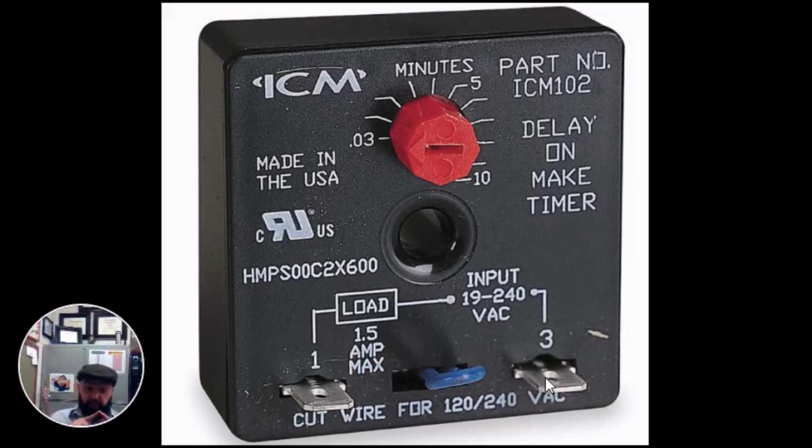Don't let me confuse you. When you're placing a wire on a relay, you are merely breaking one wire. Okay? You will never put 2 opposing legs on a relay that can touch each other. So one of the most common mistakes early techs make is that they'll see 2 wires coming in and they think they have to be plugged onto a device, whether it be a relay or a switch or whatever.